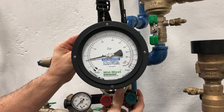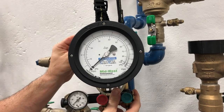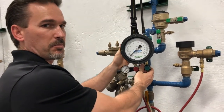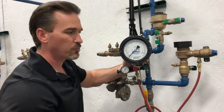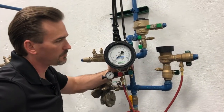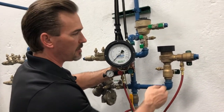We're about 1.6, 1.5, 1.4 — right at 1.4. That's a good gauge reading because our minimum opening point is 1.0. To wrap up this step, we'll close test port 2 and open shutoff valve number 1 to repressurize our PVB.